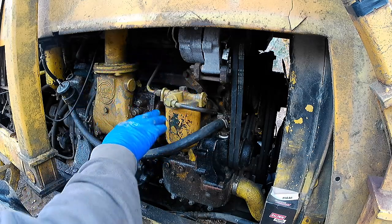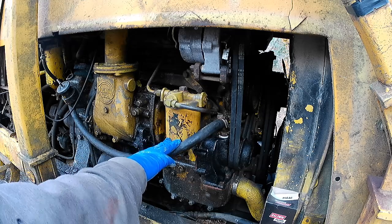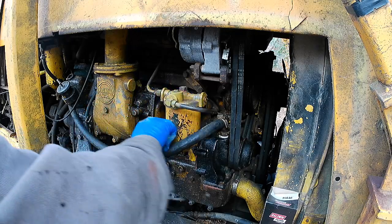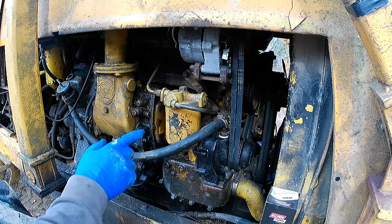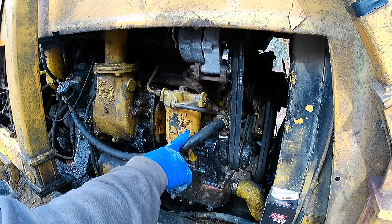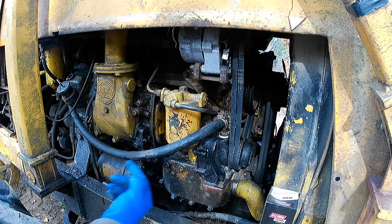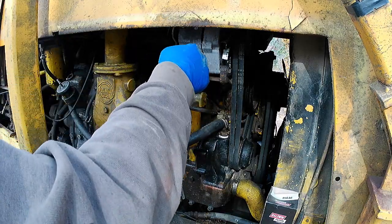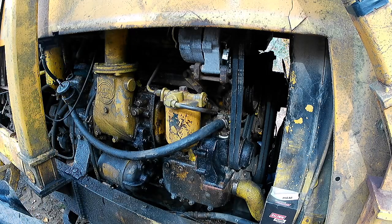But if you don't fill that, and I've had 3 or 4 friends of mine, local guys, lately where I'm going up there changing their fuel filters. They can't get their machines going, and they did not fill the filter before they put it back in. Now, some of these filters, the bolt goes on through the bottom and seals on the bottom. So when you're done, there's a hole on the top on a lot of them that you have to open to fill them. This one here bolts from the top, and this one bolts from the top. So it doesn't work that way.